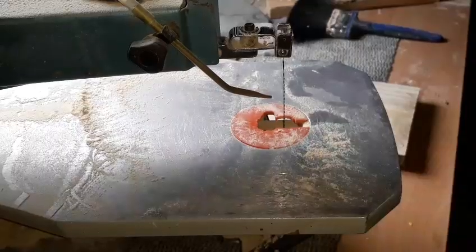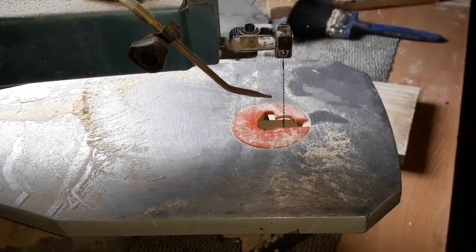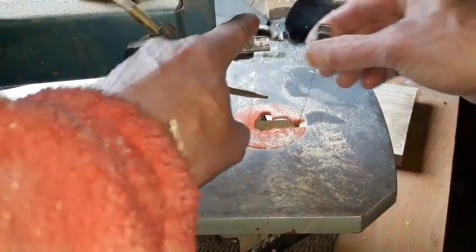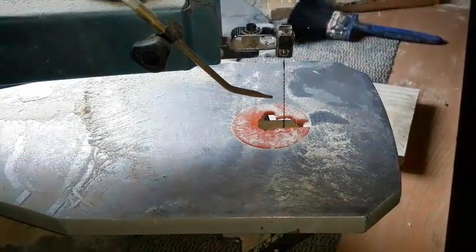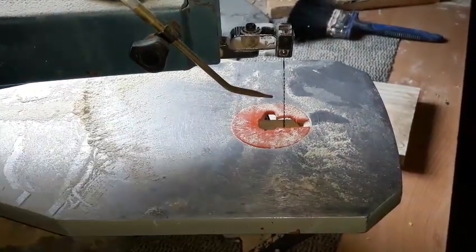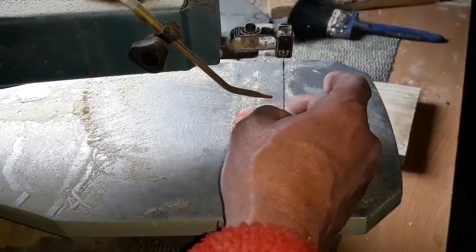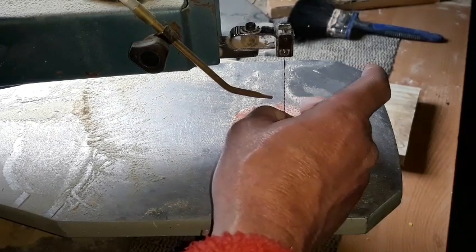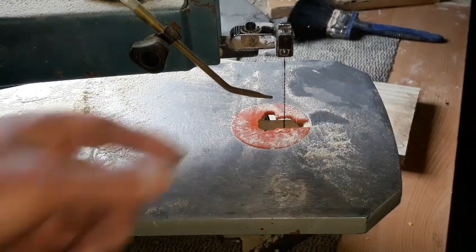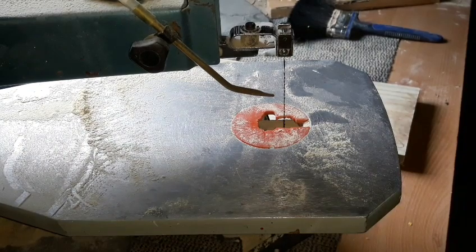Just before we start cutting, I'll show you these adapter brackets that I have to use. They literally just clip on the top and on the bottom - only on your older saws. Nowadays they don't even have these. So if you've got a nice little chrome bracket like that, it will clip on there like so. Now we have to take up the tension of the blade - you want a nice ping ping sound as I call it. You can see how loose that one is. Just get a nice little ping ping sound - do it by ear, you'll get used to it.